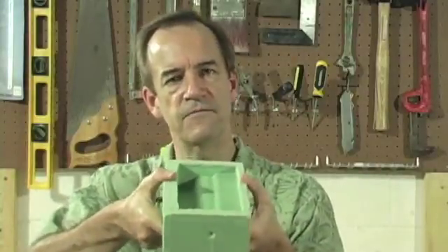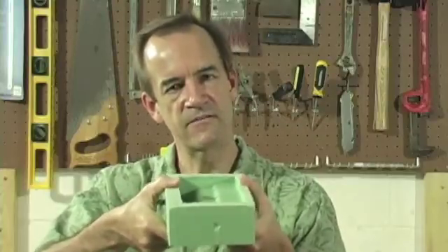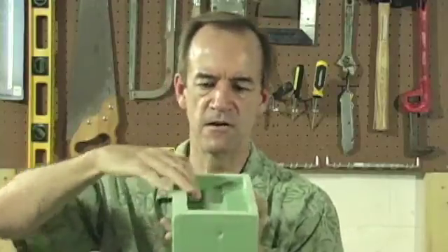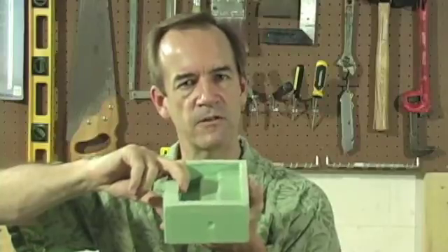As you can see, it's a flexible silicone mold. The thing is, the mold will tend to flex, and the more you use it, the more tendency it has to flex. And especially where you have a high volume of material in here, where you have a wall that's not that thick, it'll tend to flex and the part will end up being a little bit larger.